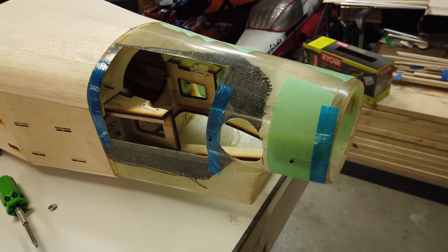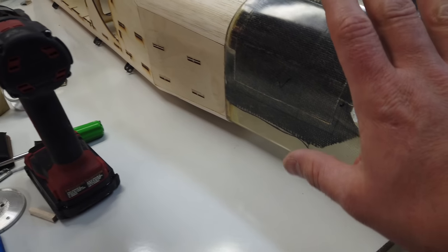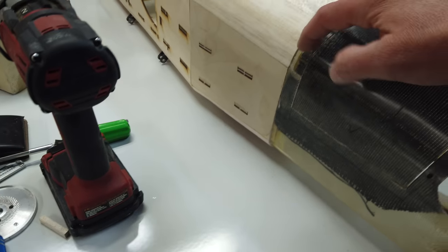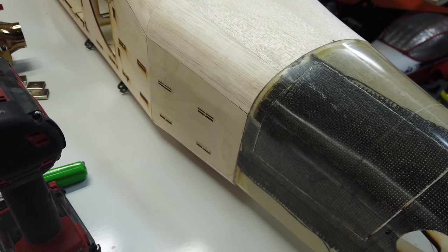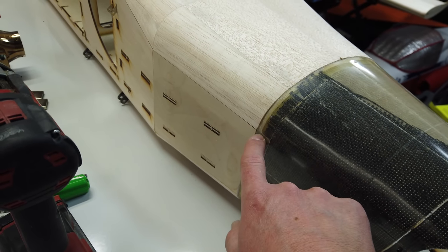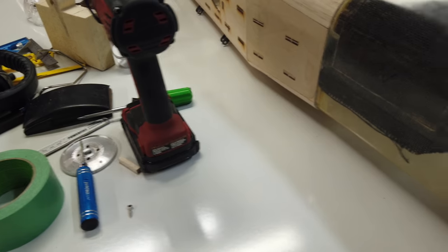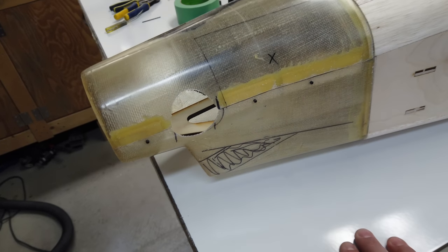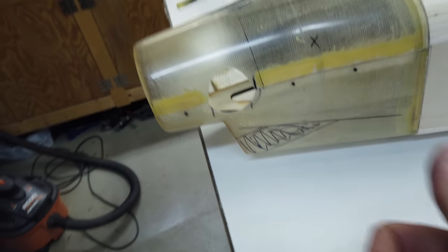All blind nuts are installed and lined up. With the door rested in place it looks amazing. Using a former glued to the cowl and bolted through the inside adds enormous support and stiffness — near the two formers there's zero movement. Two bolts on one side, three on the other side, everything is really stiff and solid. Adding the divider piece in the bottom will help further.